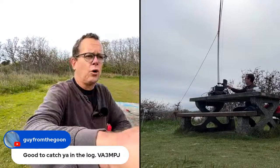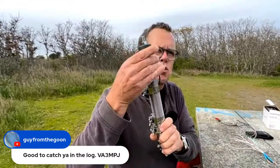And so one thing I learned too, guys, about the Mad Dog coil, if you're interested in getting it, I was racking my brain because Marty's got two different lengths. So there's the military whip, which is some of the military whips are about 8.4 feet up to about 9.2 feet or 2.5 meters under 3 meters. The problem with that is you don't need these top collars for like 10 and 12 meters because when I had this tape measure up 112 inches, I had to have the collar right to the very top for 15.